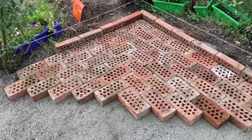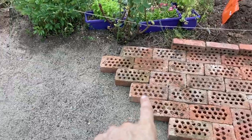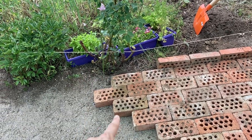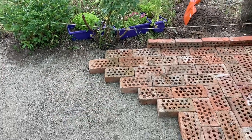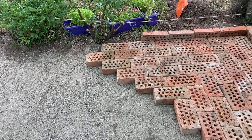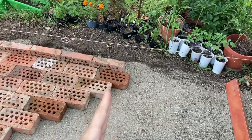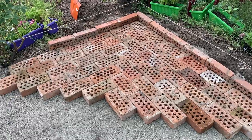I've just noticed that this brick pattern is not so good, because once this gets to that side it's gonna need to have half bricks - chop that brick in half, and then another half brick here. So every second brick needs to be half a brick, and I don't really feel like breaking all these half bricks. I'm gonna have to change this bricklaying pattern - it's gonna be the same issue on this side as well. So I'm gonna change this up and see what other brick patterns there are.